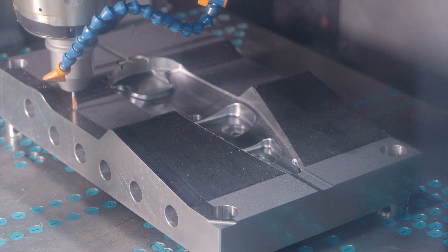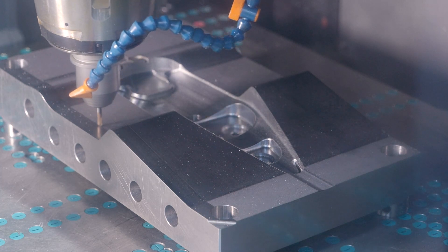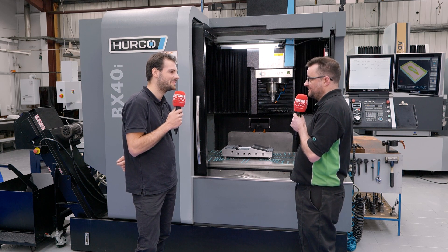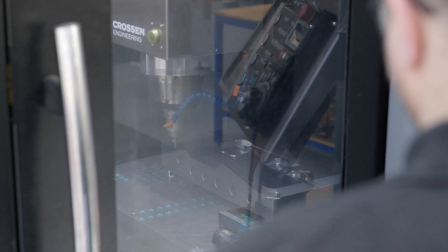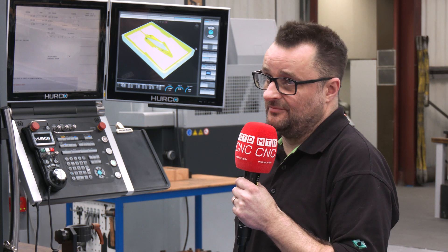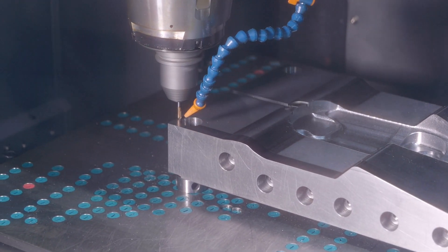And what about the machine makes it a good finisher? What do you need from a machine like this? It needs to be accurate - we're looking for high feeds and speeds and accuracy throughout the whole job. With it being a double column bridge style machine, it is very rigid and it gives us what we're looking for. And what would happen if the machine wasn't quick enough at doing these kinds of scanning toolpaths? With only having the one BX40 in the workshop, there would be a build-up of jobs waiting to go through the machine. We do need a machine that puts the jobs out as quick as possible and as accurate as possible.